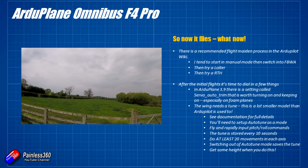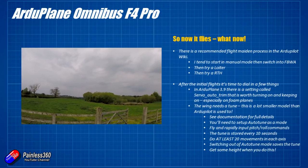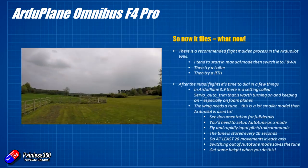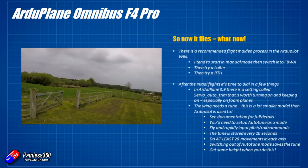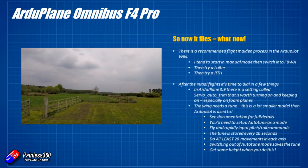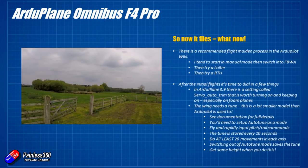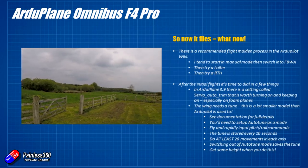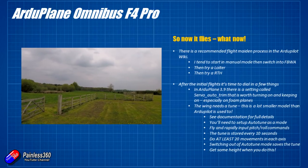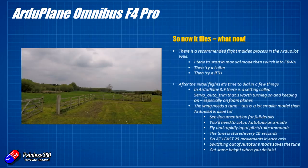The big thing this plane is going to need — and it probably warrants its own video — is an auto tune. The auto tune information in the wiki is great, and I'll put a link in the description. The short version: set up auto tune as a flight mode, get some height, then switch into auto tune mode and rapidly input pitch and roll commands — bang the sticks around. You don't have to wait for the craft to respond aggressively; you're just teaching the flight controller the reaction. ArduPlane compares and tunes the PID settings for each axis, saving every 10 seconds.